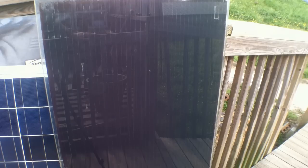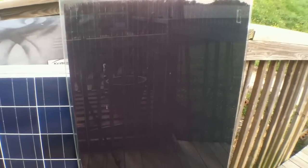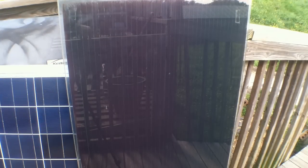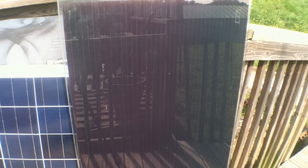Now, the great thing about that type panel too is it's 48 volt. As opposed to these type panels like the mono and the poly where you usually get them in 12 or 24 volt, these being 48 volt, you can hook them up for applications such as air conditioning because you'll need a lot of power input. So if you have a 48 volt inverter putting out 6,000 or 7,000 watt, you've got a huge option with that. But the big thing as far as power draw is if you're going to pump water — a lot of the water pump systems are 48 volt, so with this application you'd already be up to that voltage in your system to run through the charge controller.